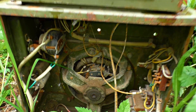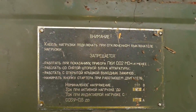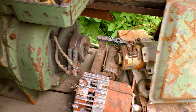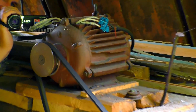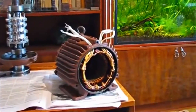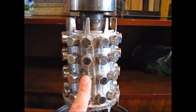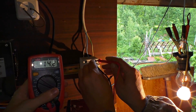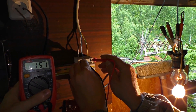This hydroelectric power plant has been operating for more than one year, and during this time many generators have been tested on it — including one for 6 kilowatts. But the best results showed with a homemade generator based on a three-phase motor. The windings were rewound with thick wire to a lower voltage, the iron rotor is cut down on a lathe, and neodymium magnets are fixed there with aquarium silicone. Such a generator on this turbine produces 600 watts of electricity around the clock, every hour, without interruption. It's quite impressive to get so much energy for free.